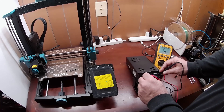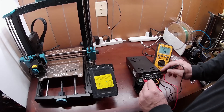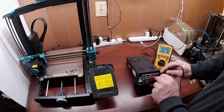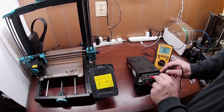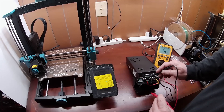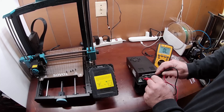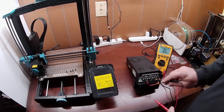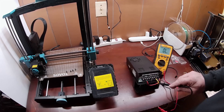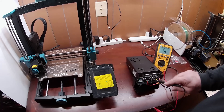It's telling me that one is one terminal and one is the other terminal. I know this is a positive terminal and this is a negative terminal. If I go over here to the next one, those are common, but if I go over here, none of those. Now if I move this lead to here, those are common to each other, and those are common to each other. So we've got 1, 2, 3 positive powers, and 1, 2, 3 negatives.